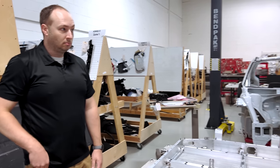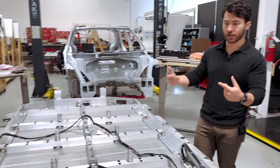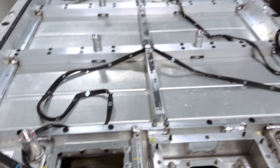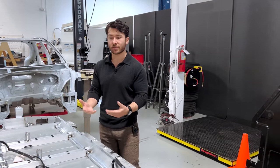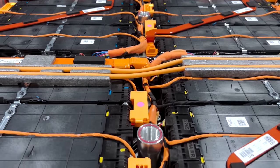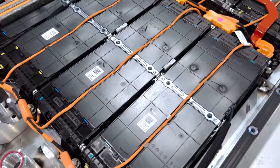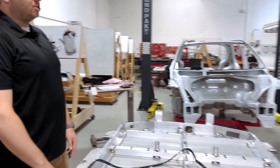This seal is more service-friendly — another important aspect. A lot of this pack was designed with service in mind, as evidenced by the two service access panels on the underside, so that's likely driving the decision to use a more costly seal. We do debate often about how likely these packs are to actually be opened to have a single module serviced, since getting a single module out is usually not a super simple task. However, this pack was actually one of the easier ones to remove a module from.